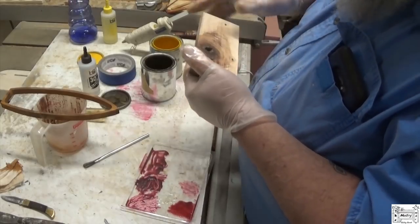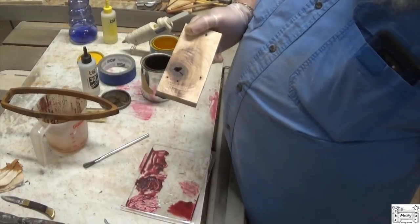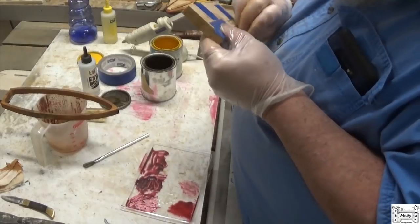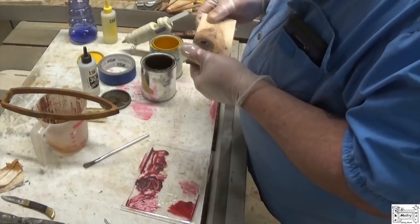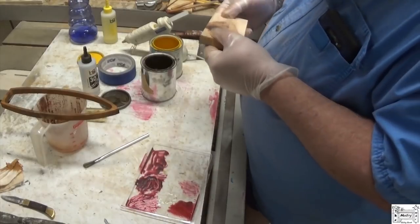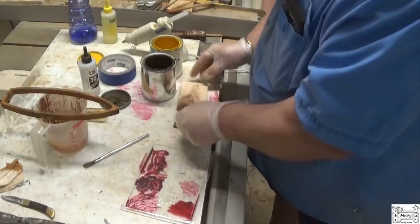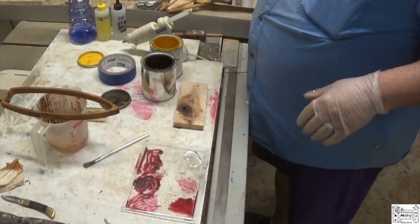Okay, I've got this thickness through my sander. It burned on me a little bit because even though I was running it only at 10, the speed on my conveyor, this rock maple is just so hard. I mean, it's hard, and it burned a little bit. But I can sand that away with my random orbit sander. I got a couple of holes, so I'm gonna fill these with 30-minute epoxy. I'm still gonna have to wait overnight for it to cure, but that's okay.